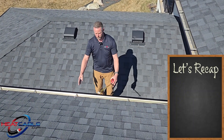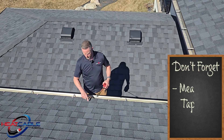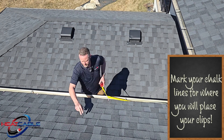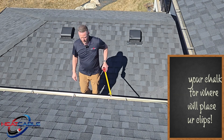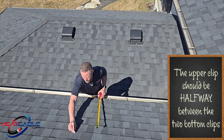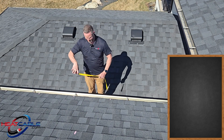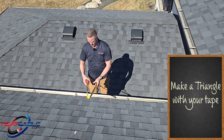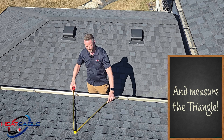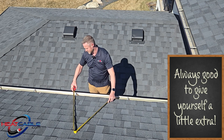Now when I get to a point where I want to calculate how much cable I need, I'm going to go up six shingle exposures — one, two, three, four, five, six — eyeball the center point, and put a clip right there. Then I can take my tape measure and do a loop like that, taking the measuring tape about two inches higher than I need. I got 77 inches.